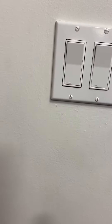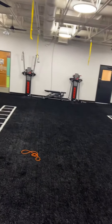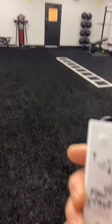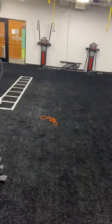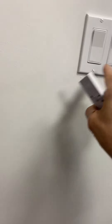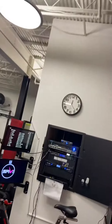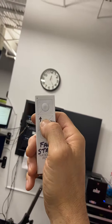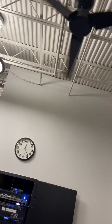When you turn the stage fan on, make sure the wall switches are off — otherwise you'll reprogram all of the ceiling fans. Do not turn the stage fan on and off without the wall switches being in the off mode. So if you want the stage fan on, the wall switches have to be off. If I touch this now, watch — that's going to turn the fan off.